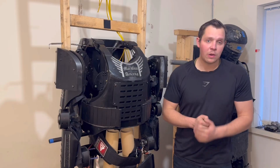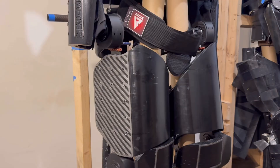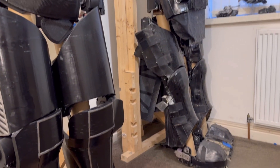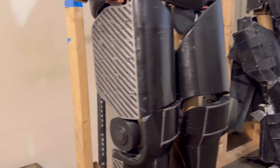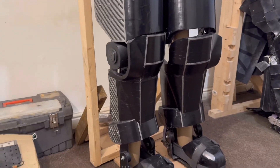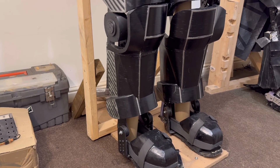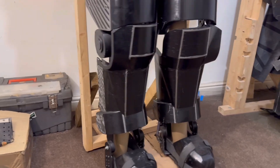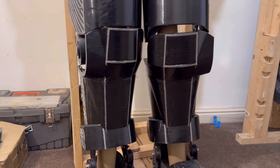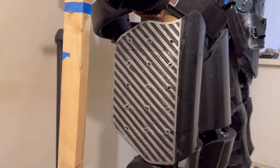I've also had the thought that wearing a MOLLE plate carrier underneath could add protection while also allowing me to modify the back of the plate carrier to attach to the exoskeleton, which should increase comfort and how well the exoskeleton fits on the torso. Moving on to the legs — there's still the odd mold line but compared to the old prototype it's a vast improvement. It all fits pretty neatly around where the actuator is going to sit. I've actually decreased armor thickness a little around the ankles as extra weight at the end of a limb feels horrendous.